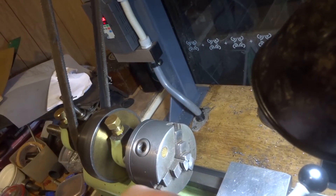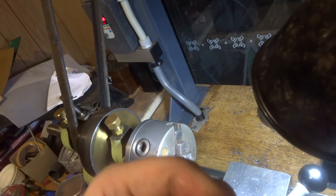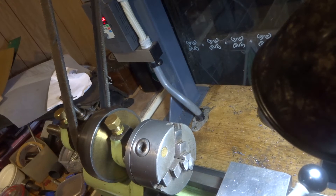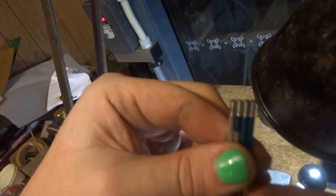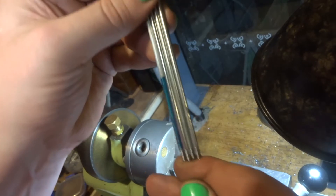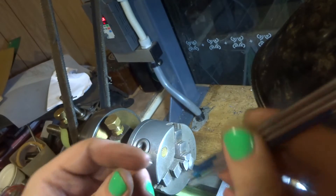These threaded so easily because they're actually 3mm rods and I've threaded them 1/8th Whitworth, because I've got a tap and a die for that size, and we still need to make some nuts. So that's one end there, now they're in, and we've got 4 bolts.